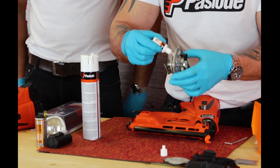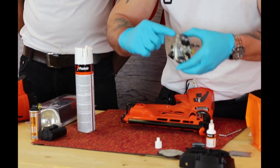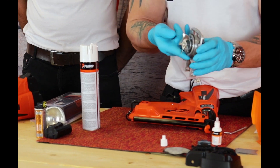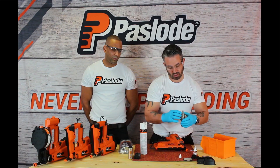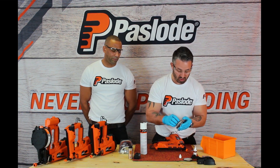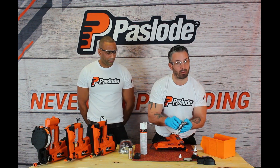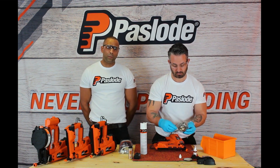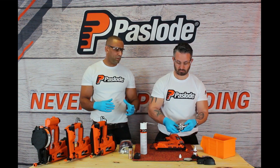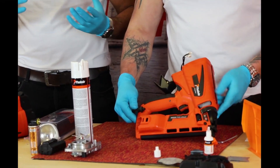Place the oil around the metal clips and, using your finger, gently work it into the clips. It's also worth noting that the clips have a gap in them, so make sure they're not together — make sure they're about 180 degrees apart. Our premium tools rely on a vacuum system, so if the gaps were aligned it could compromise the vacuum inside the tool.